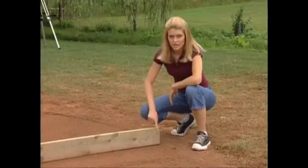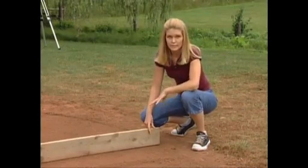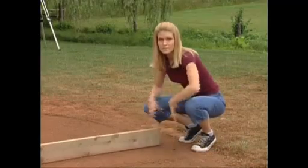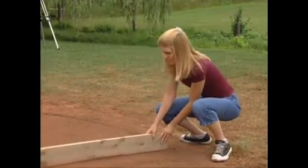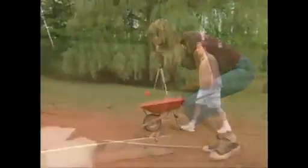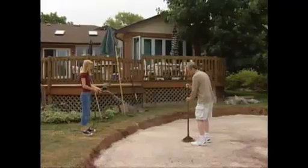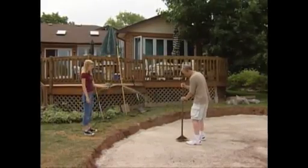When you finish, double check the outer 12 inches or 30 centimeters in this area where the pool wall will be, making sure there are no gaps or dips in the ground here. To ensure this area is completely level, you can pack in a small amount of crushed limestone. Tamped down, it makes a stable base and is quite easily leveled.